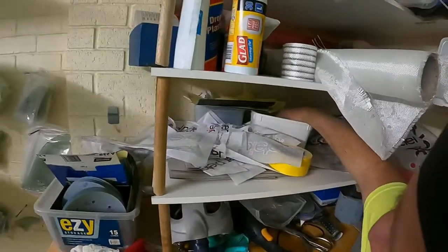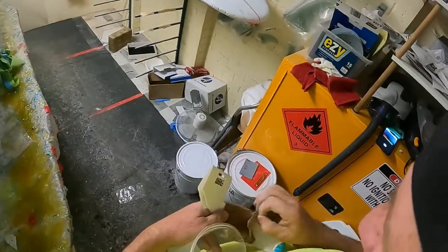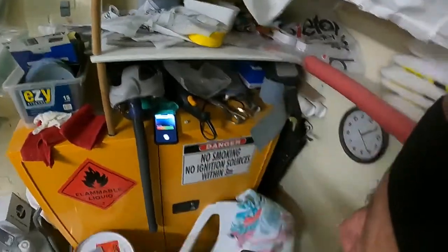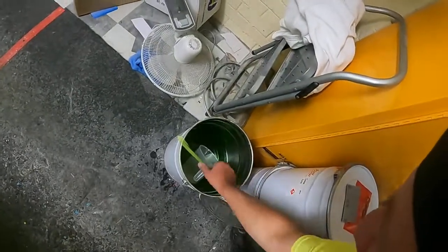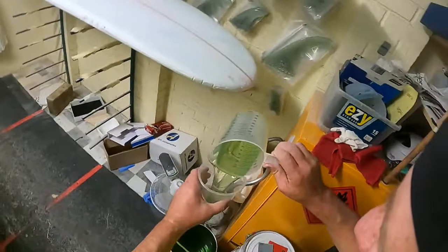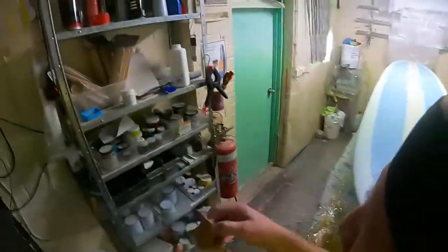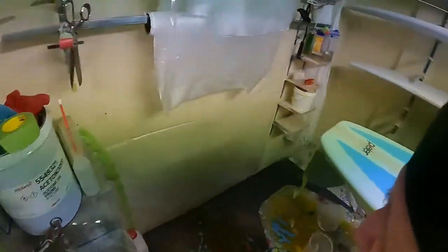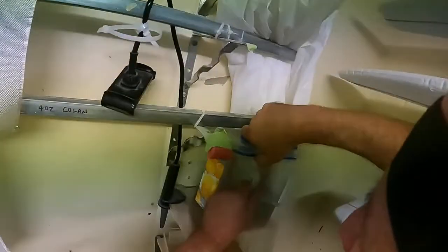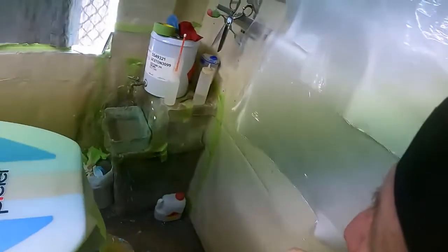Finish coat part — very easy. You get one of your stockings. I know it's overkill but I like overkill. Now I'll get my resin — roughly that much, I'll go by eye, just under 400. Your stocking, your stirring stick. Now I'm going to put my styrene in first, but first I'm going to take my brush, which only ever gets washed in clean acetone, never dirty. And it gets stored in its own container so there's no dust particles in there.